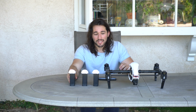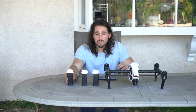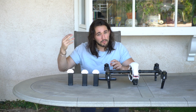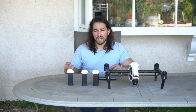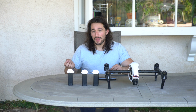So in order for it to get a correct reading of the battery, you have to fly the Inspire off maybe 1 or 2 feet just in case of a failure, so it won't crash and burn. The computer has to run its tests, and it has to check each cell in order to get a better reading of the battery's charge. Now this takes up to 2 or 3 minutes.